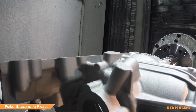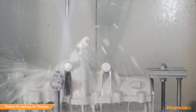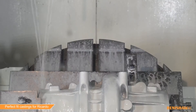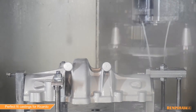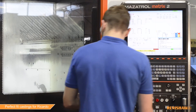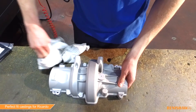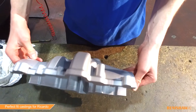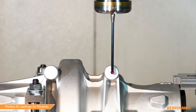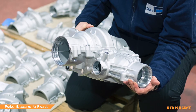The main case has multiple operations. We have two operations on the horizontal to start with, it then moves onto the five-axis for an operation, and after that it comes back onto the horizontal. We then take the cover and the main case, bolt them together, and machine them as a complete assembly on the horizontal. They are then taken apart, kept in pairs, and we machine the tooling holes out and do the last operation on the horizontal. So in total there are five horizontal operations for the assembled part complete.